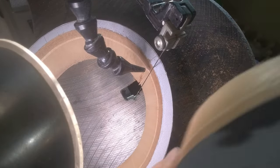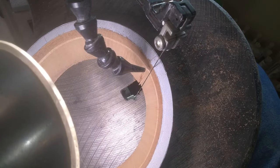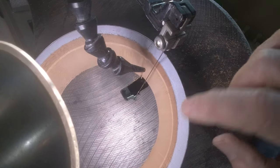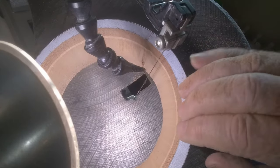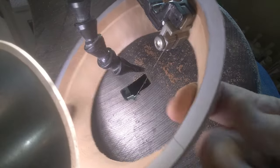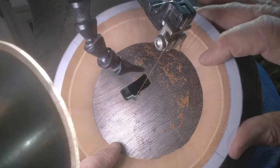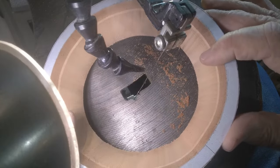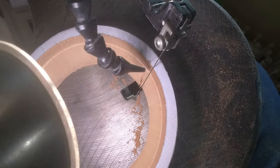That's the top ring cut. I've got this leftover piece - it's too much good mahogany to throw away, I'll figure out something to do with that. As you look at this ring, the piece at the top is actually the bottom - that's what's going to glue to the top of the accent piece. Then you use that extra material from the angle lift to kind of shape it around the bead or edge on the bowl. Now I'll go check my glue-up job on the maple. If it's ready, I'll cut it; if not, I'll start on the bottom rings of the plain mahogany blank.